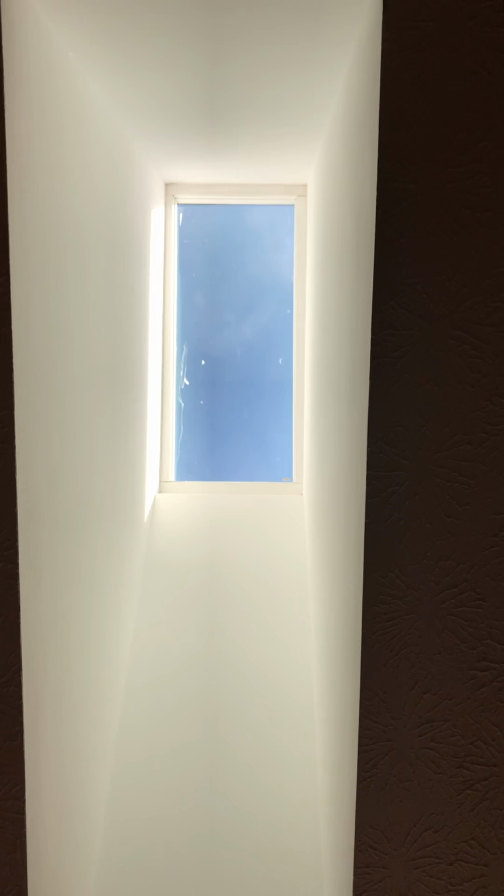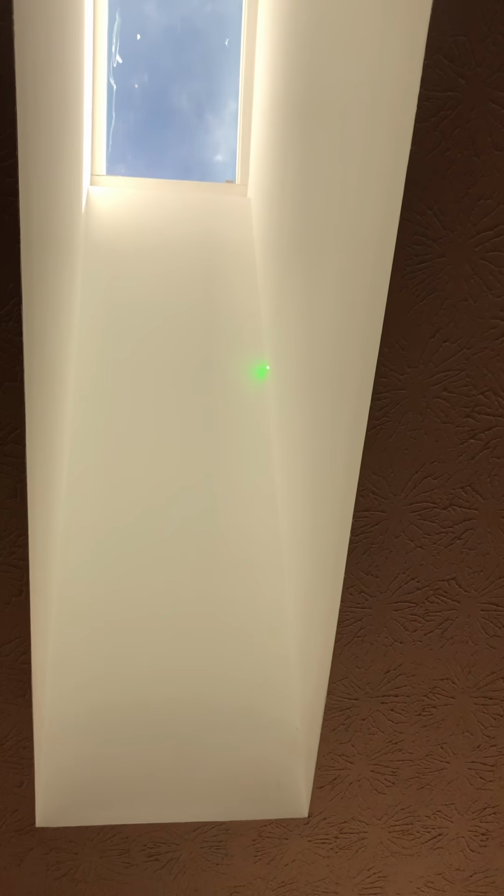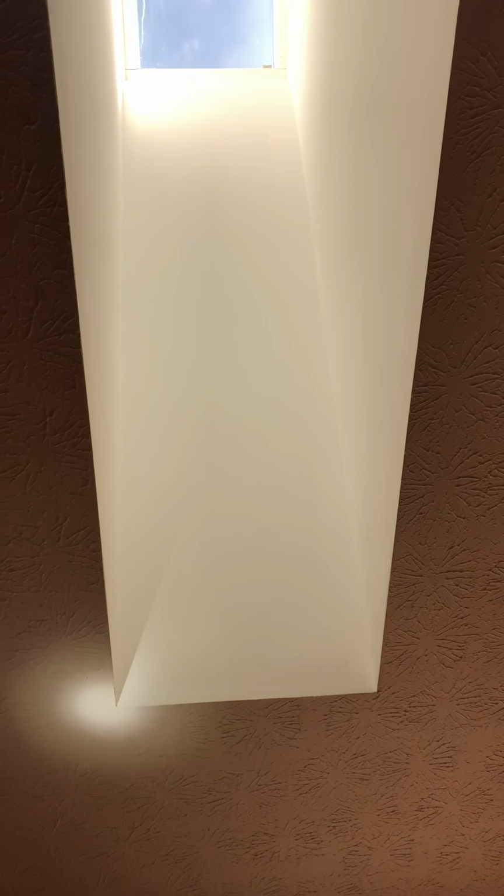All right. Okay, now this area also has skylights. So I almost always tell people it's not a matter of if, it's when they leak. They almost all leak. However, I didn't see any leaks in these. So that's a really good sign, especially at the lowest part of the skylight, the roof pitch, coming down this way. We see some sort of stains up through this cavity. I'll get a small little pointer out. So we'd see some sort of stains in this area here, and of course it would run down this framing on either side. And sometimes this is a little high, but we'd almost see some staining right here at the very edges of these, which I didn't see on either side of these skylights. So that's a good sign.